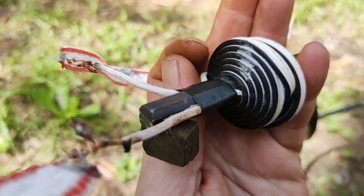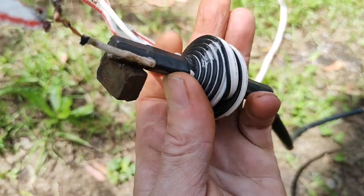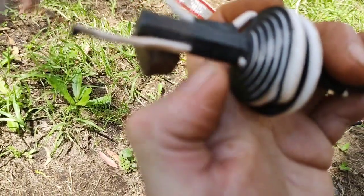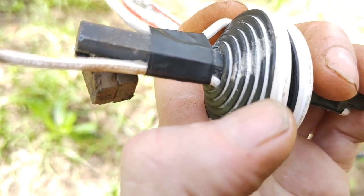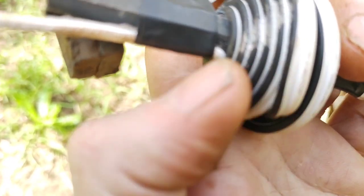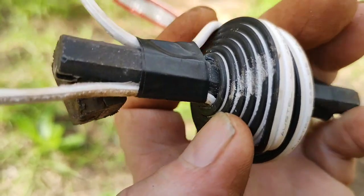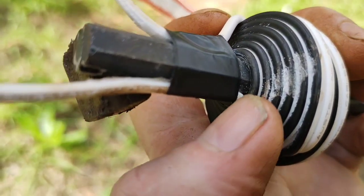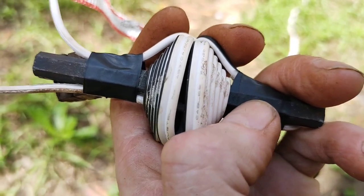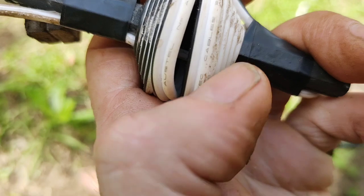You get your speaker cable and spread the black-and-white or red-and-black wires apart. Run one out this way and one out this way, then start winding outward in a conical sense, because that's a great cable arrangement — the bulge of one turn sits in the recess of the previous one, making it really snug and increasing the distributed capacitance. Once you've spiraled out six turns, go back to the middle with the continuous speaker cable and in the same direction wind out another six turns.